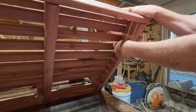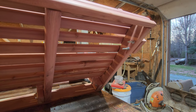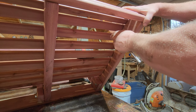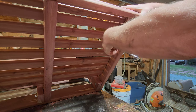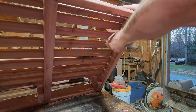Think I could buy a little bit longer bolts there, do you? Just a little bit. Using them for other purposes, I would get some more appropriate to size. But this is okay. Tighten this up like you did the back. You don't want it god awful tight. Just snug it. You don't want to split the wood. Watch the carriage bolt sink up into the wood and get flat.